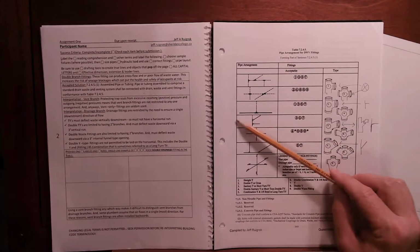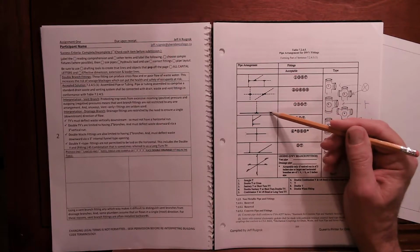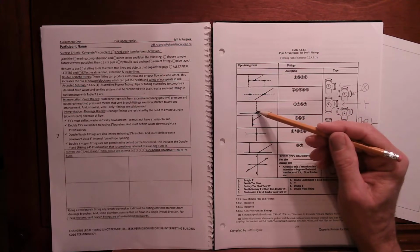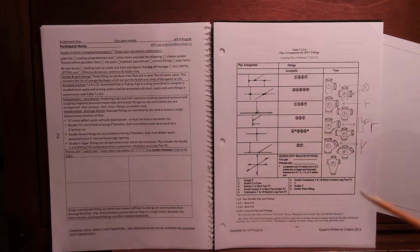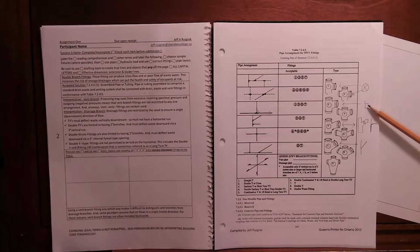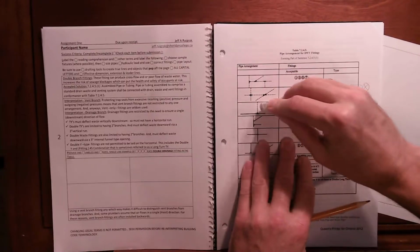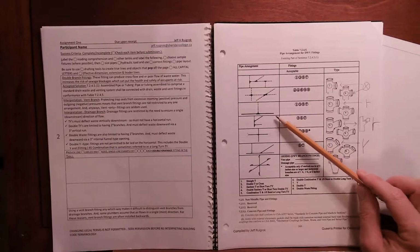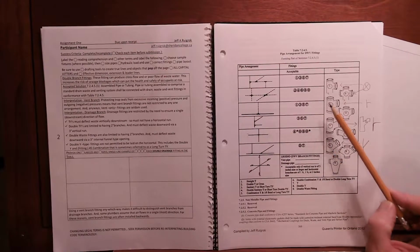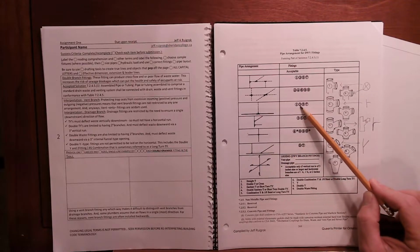This one in particular, a lot of folks will tell you you have to have it flowing downhill. So if this was the flow of the waste, this would have to be a fitting that looks like this, so it comes downhill. Anyways, watch out for that. I'm not looking for any of that because you're just going to use a T there anyways, much like they have drawn here, just a simple T. So no big deal. But you might get instructors who insist on having that fitting put in a specific way, so watch that. Fitting 3 is what I'm talking about.